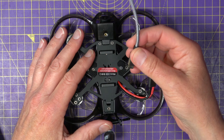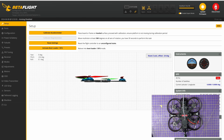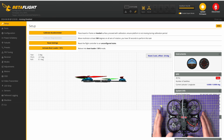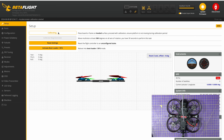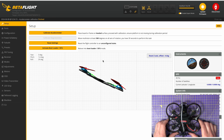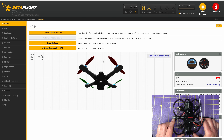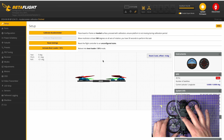Right, let me show you. So let's get this connected up to Betaflight. The first thing to do is to make sure that the quad is facing away from you — it doesn't have to be this way around, but it just makes it a little bit more obvious what's going on. So quad's facing forward. We go into Betaflight, first thing to do is to reset the Z-axis — that's just a configuration thing for this simulator. Then calibrate the accelerometer. Then we're in a known state. Now, when I pitch the quad up, the simulation in here should go up, but it's actually rolling right. If I pitch forward, it rolls left. And if I roll right with the quad, it's actually pitching down in the simulator. And if I roll left, it's pitching up in the simulator. So there's something wrong in the flight controller configuration to do with the gyro.